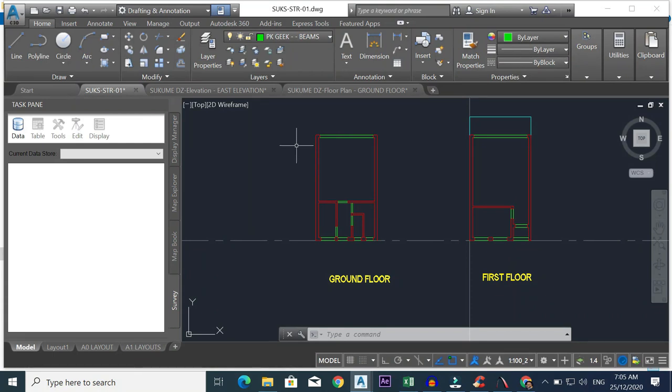But then again, the concrete is a bit expensive, but he also wanted something strong. I don't know why he wanted a frame structure, because you could have just done load bearing bricks and had them take the load down, which was much easier. We would just need to design the slab. But anyways, it is what it is. He has to do what he wants. You can't force him. And I know maybe the bearing pressure for the soil was a bit low, but we're just going to use a minimum of 200.